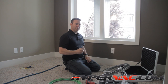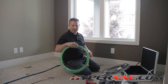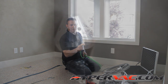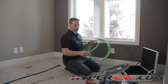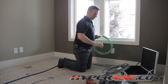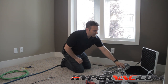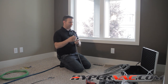The blow gun worked fine for the first few years of the air duct cleaning industry, but it's not the greatest go-to anymore. After the blow gun, the next evolution was the forward skipper line — a semi-flexible rigid tube with a ball of holes on the end that blow forward. You force it down at the register and push debris forward with air pressure. But you still never knew if the system was completely clean, so the last evolution was the forward skipper line camera.